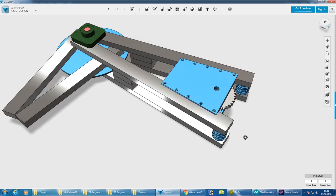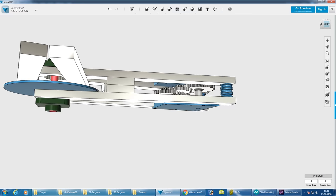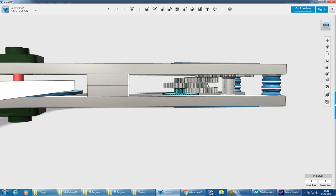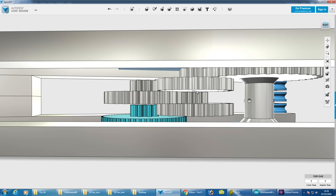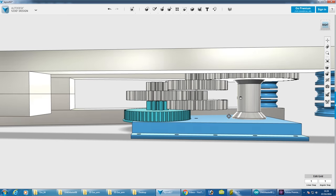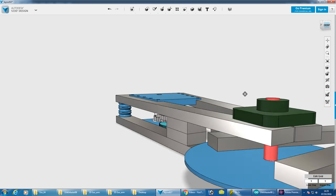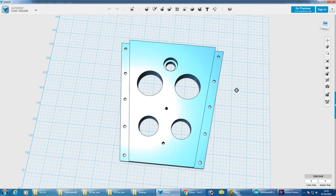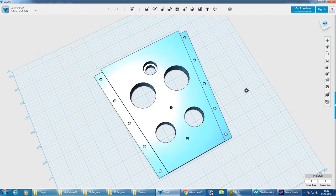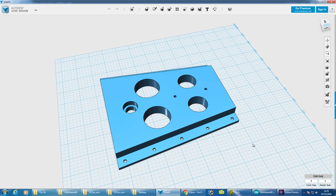I've made these tapered pieces that fit in the V shape of the arm. They have all the same mountings as that test assembly — holes in one side for the axles but not the other so they don't push through. I've got just enough spacing between the gears for lots of washers, and there'll also be some spacers at the bottom so those gears don't rub on each other. Pretty much ready to print that out. Here's one of my plates ready for printing — I've made some additional holes in it to stop warping and to enable me to see the gears. It doesn't need to be completely solid and it'll be just as strong.